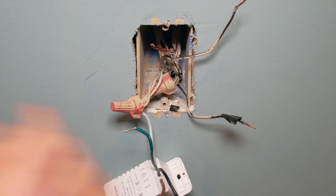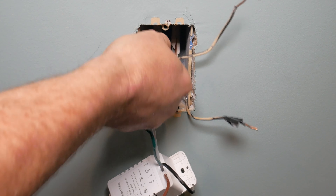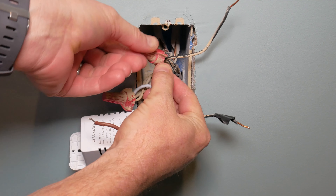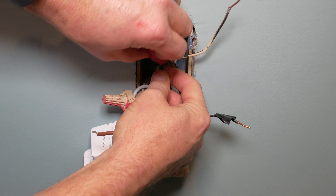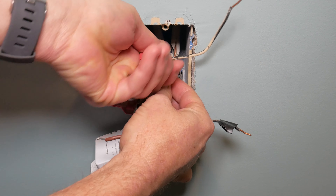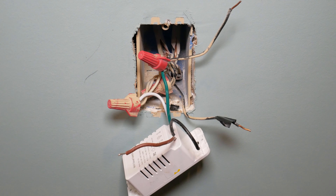For the ground wire: you don't have to have a ground wire — it may be that you don't have one in your box and can't hook up the green wire, and that's fine; the switch will work without it. However, if you have a ground wire, I highly recommend you hook it up. In my case the ground wires are exposed copper; yours may be the same, green, or they may not exist at all.